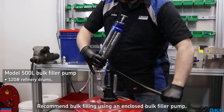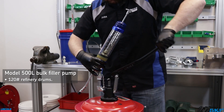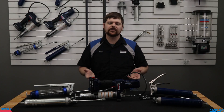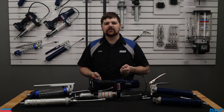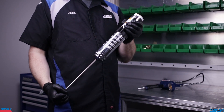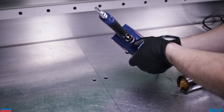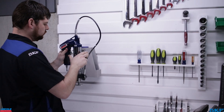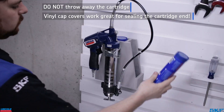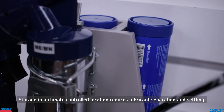To reduce chances of buildup, always fill the unit in a clean environment to prevent any debris from entering the dispensing chamber. Always use good quality grease and monitor use to prevent lubricant from remaining in the gun for too long. If the gun is to sit idle for an extended amount of time or subjected to harsh conditions, we recommend removing the grease cartridge or bulk loaded grease after the job is finished. Clean out the dispensing chamber, then store the unit empty in a cool dry place until use is required again. Store the cartridge with both ends covered until next use — this prevents any contamination or leak issues from occurring while the unit sits idle.